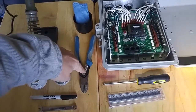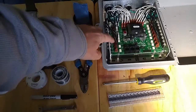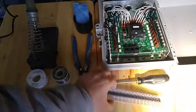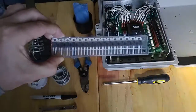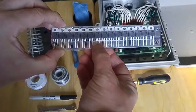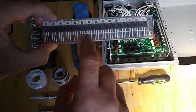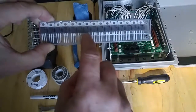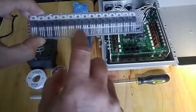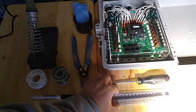You'll need some wire cutters. What I'm going to do is after I get the ICs soldered into the board, I'll use these to cut the legs off — as you can see, the legs are really long. You'll be cutting them just about three-quarters of the way up to the contact land, because the board isn't that thick and the fat section will sit almost on the board. Then I'll cut the legs off so they're not sticking down and potentially shorting something out.